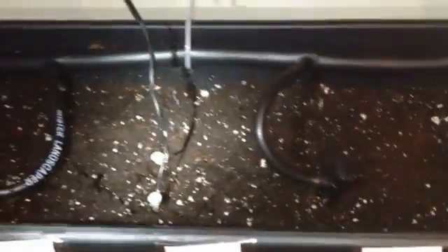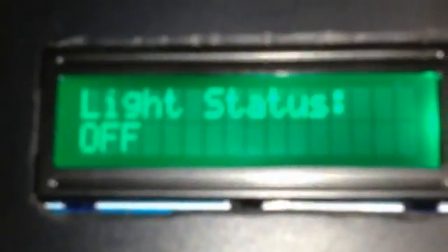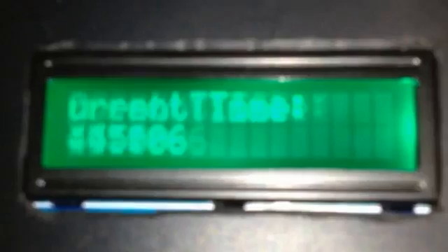Right there are my two nails — I'm using the nail method as my moisture sensor, which runs up to the Arduino control box right here. The LCD gives you some summary readings and information at a glance of what's going on. Lights are off right now, which means it hasn't been watered today within 24 hours. It gives you the current time and a humidity reading as well.